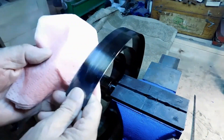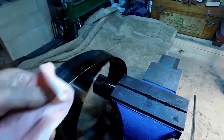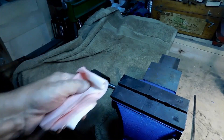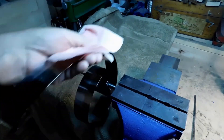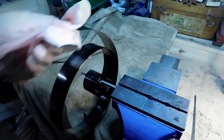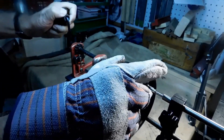A little bit later — I've got red hydraulic fluid on here and that's what I like to use for mainsprings. If you go on forums, almost every watchmaker has their own little concoction they like for lubricating mainsprings. This works for me and I like it. I'll do it at least two times but this mainspring is looking really good, so just one more time should be plenty. You never want so much oil that it's coming out.